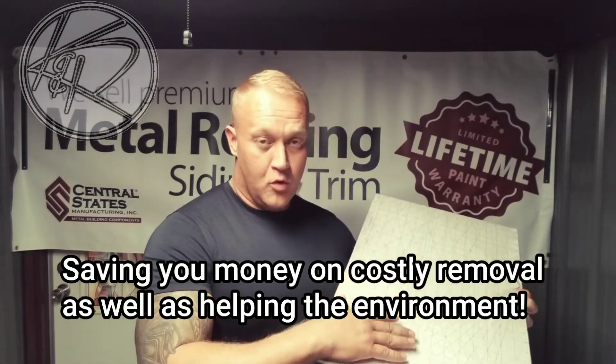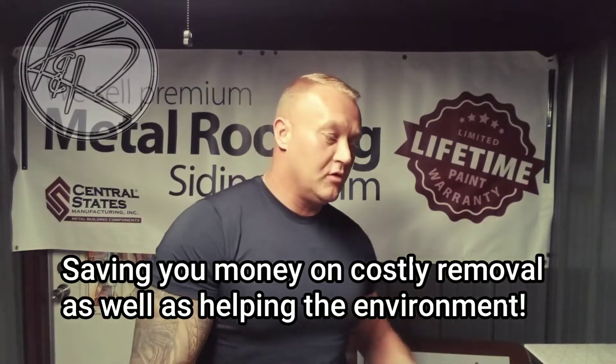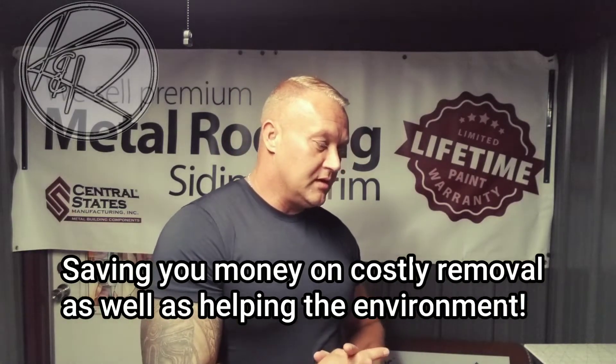You have the quarter-inch foam which goes down. There's not a lot of R-value to this — I don't want to be misleading. But if you look at how styrofoam actually works, it's just an insulation barrier. What we're trying to do is keep that thermal transfer from taking place into your attic. If I took a thin styrofoam cup, put ice in it, and set it outside on the deck mid-summer, you come back an hour later with a lid on it and you've probably still got some ice in there. That shows you that the insulation is just going to keep that heat out.